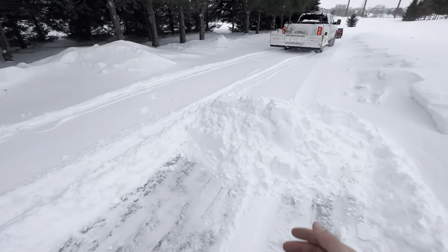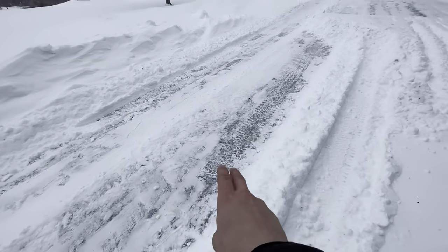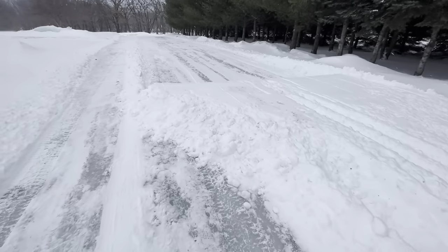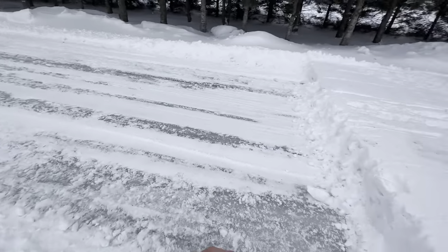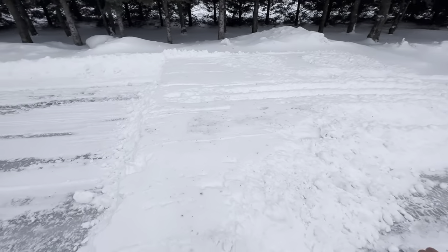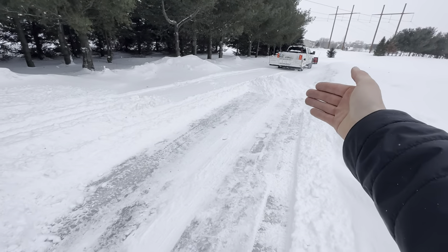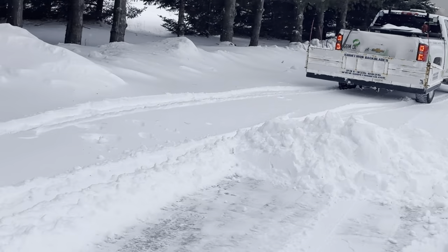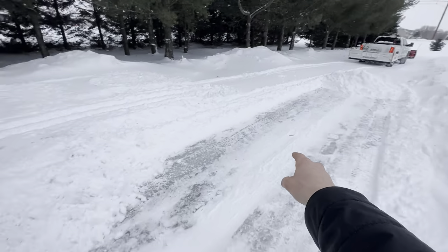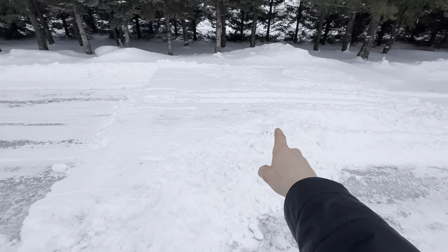Check out the difference in how much snow the back blade can move versus the front. In the same distance — about 100 yards with four inches of snow — here's the embarrassing amount of snow the V-plow moved in scoop. Little pile here. Here's the pass I made, and then with the back plow — 16 feet wide, my wing was halfway over the already piled area — there'd be even more snow here. Look at the amount of snow. You can't even compare this to that. This is literally 15 times the amount of snow, because of how it's boxed — the square footage it carries versus a front plow is just insane.